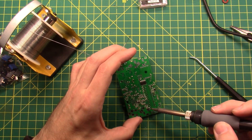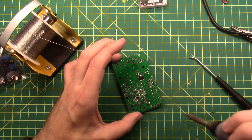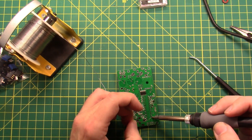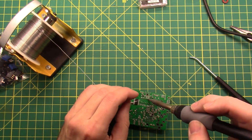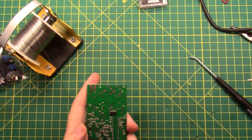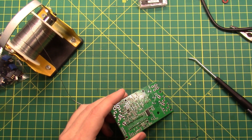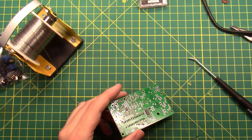I had a little bit of what's called a solder bridge connecting this pin and this hole together. I just took my soldering iron and wiped down in between them — problem solved. I put my safety glasses on and inspect my work. My first and last pins were a little dirty, so I'm going to clean them up by reflowing the solder, and that will clean right up nicely. Actually probably not enough solder on that pin — much better.